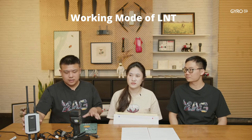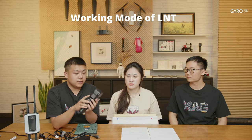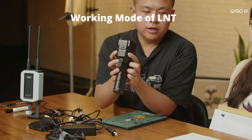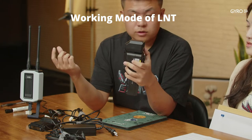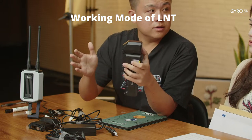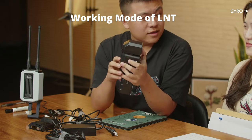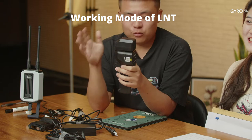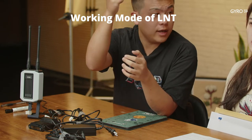Set it high. And the second thing to pay attention to is the Wi-Fi antenna for our SS2. It is here. There are two, one, two. And this one must face the LNT, in front of the LNT, and make sure there is nothing between them. Even your body is bad. Even if you're too fat, that's only a joke. Make sure there is nothing in between, and we also need to put this one higher.